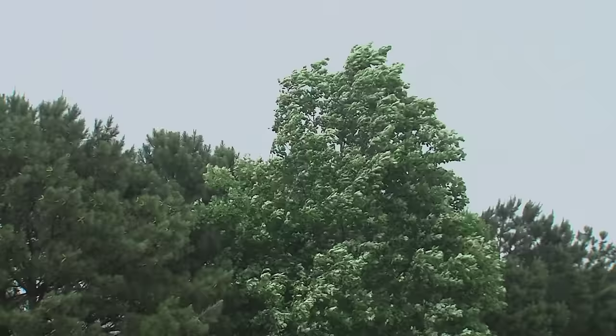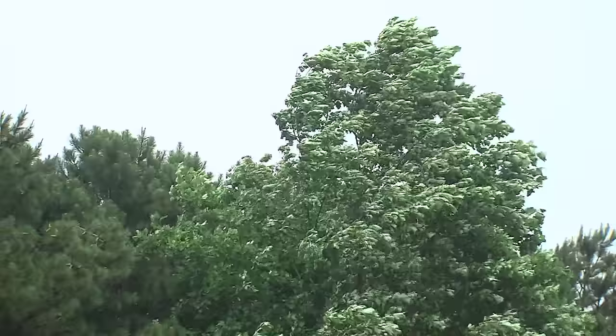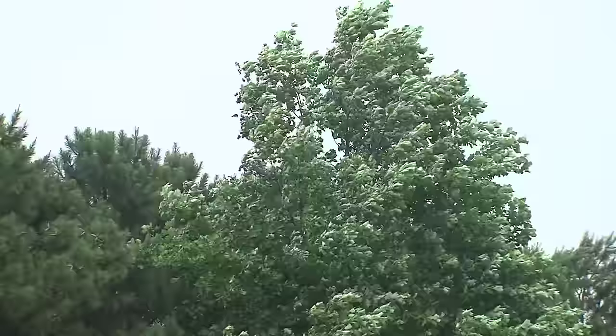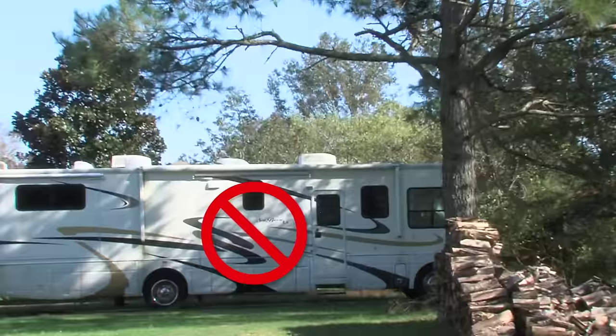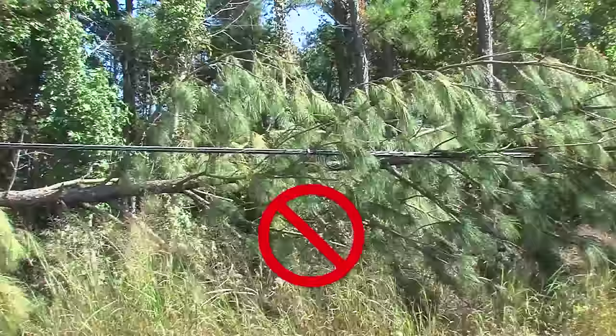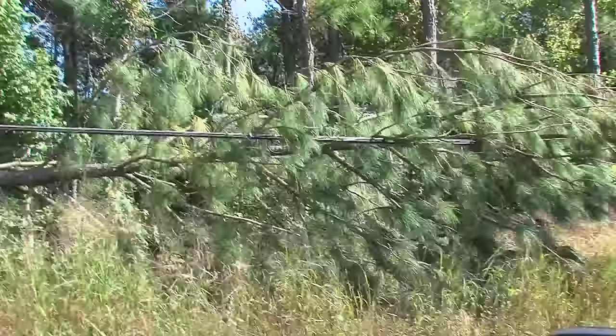Don't do this work at night or when visibility is limited or if the weather is bad - only use your chainsaw in daylight hours. If you're going to be felling a tree and it's a windy day, you may want to hold off on that work, waiting for calmer conditions, or call in a trained professional. Wind can drastically affect the direction in which a tree falls, creating extremely unsafe or even deadly conditions. When planning your work, make sure there are no structures or other property in the vicinity that could become harmed. Never work on a tree remotely close to a power line in any direction, and never assume that power lines are not hot. If there are power lines in the area, stop and call the proper authority or a trained professional.